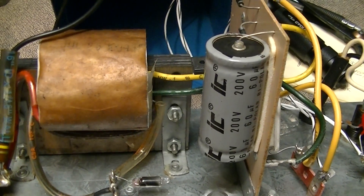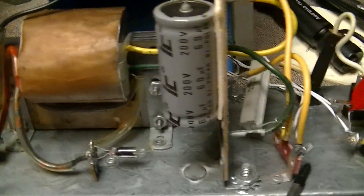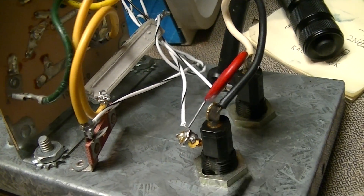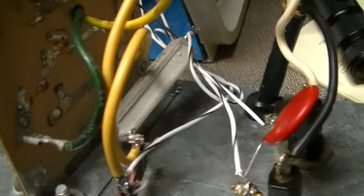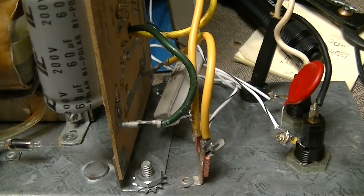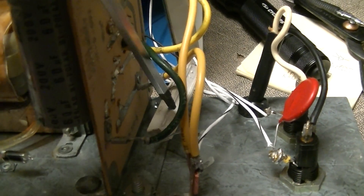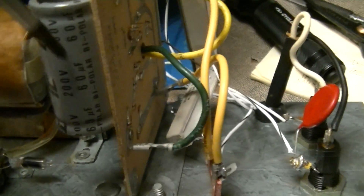This is the guts of a Universal Cooperative's Super 2000 electric fence controller. Inside, fairly simple: there's the mains cord in, going to a pair of fuse holders each with a 1 ampere fuse. Then there's this red thing which is a metal oxide varistor for surge suppression, since lightning transients are a big problem in the applications this is likely to be used in. And there's a 500 ohm 10 watt wire wound ceramic resistor for inrush current limiting and anti-short circuit protection, which I'll get to in a bit.